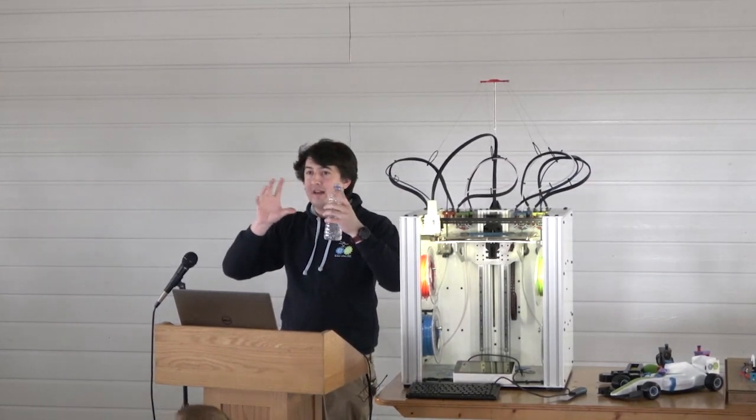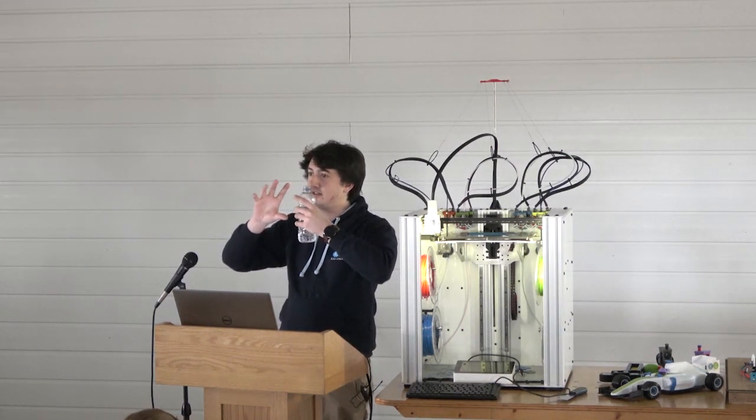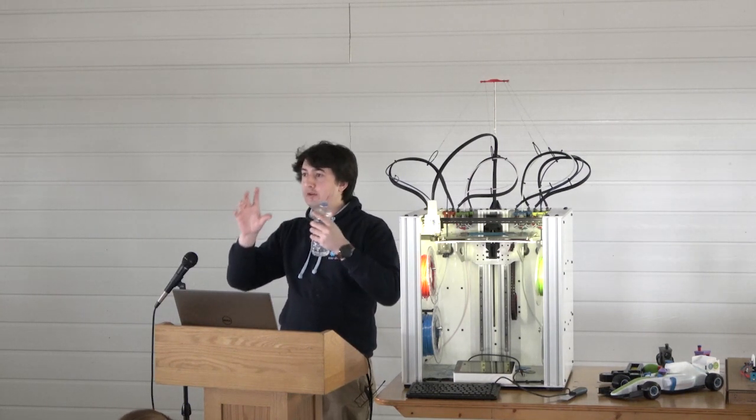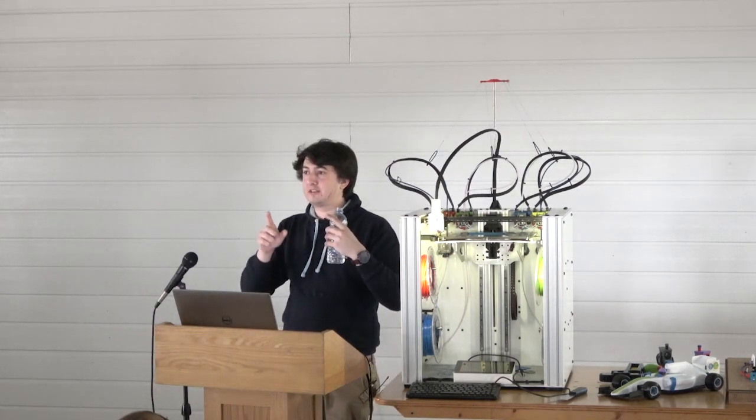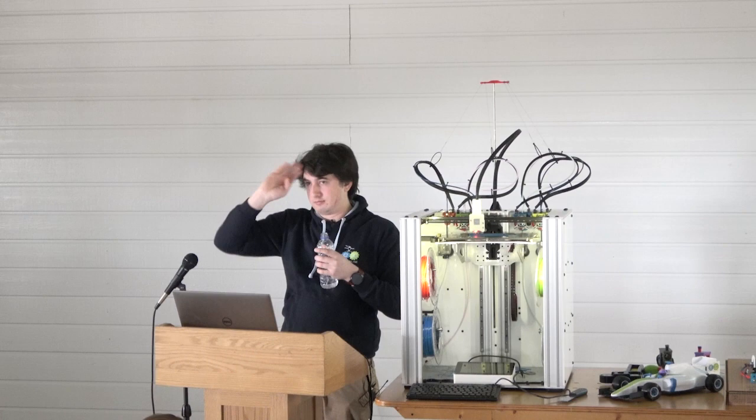Okay, we'll start here. You. I was just curious, have you thought about putting like dip switches on there or something so it can recognize the tool head? Yes, and in terms of bed leveling, we want to use the kinematic coupling as the switch and also as the bed leveling device, because kinematic couplings work like Renishaw touch probes. Yes, basically. We can do it, it's going to rock.